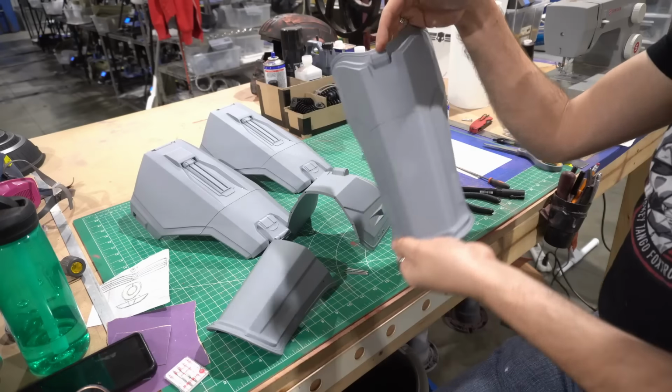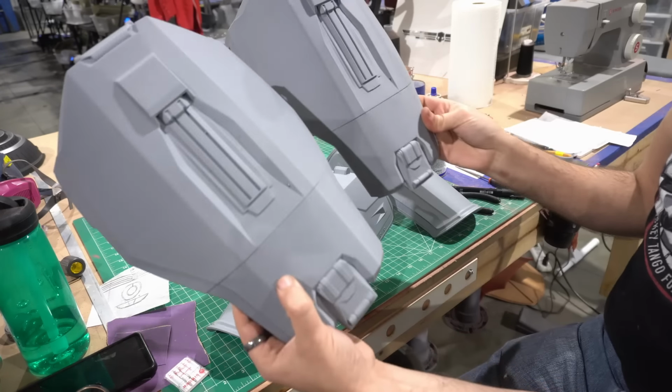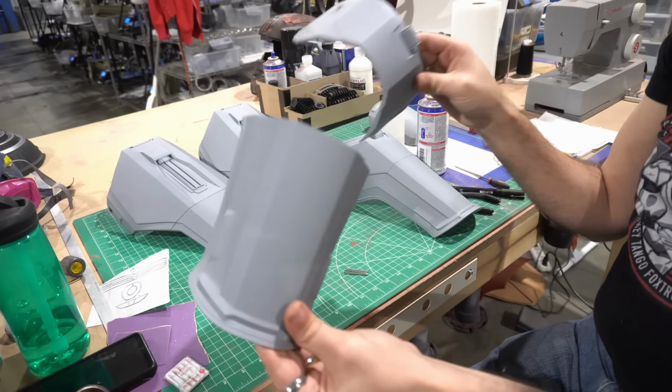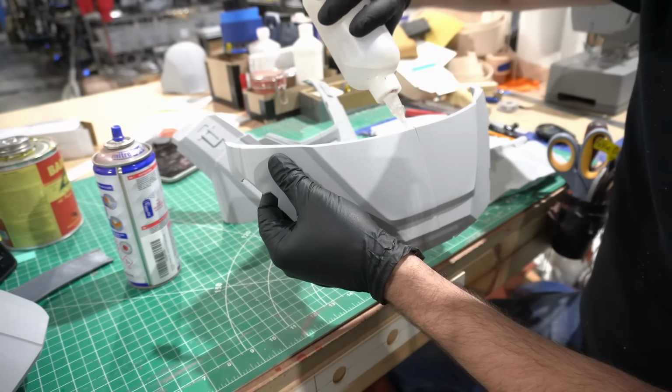So all the 3D printed parts were printed on our Bambu Lab X1 Carbon 3D printers at 0.16 layer height, so very nice, really smooth details. They were printed in Polymaker Cos PLA, which is the more sandable version, Version A of their Cos PLA blend. Fantastic stuff. Really sandable, really great to work with, more durable than normal PLA. We really recommend them. It's super hard to get right now though. So find it if you can, otherwise normal PLA or PLA Plus will work just as well.